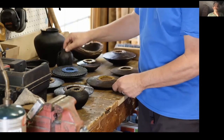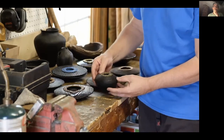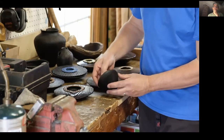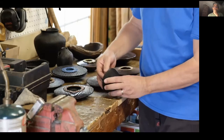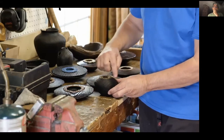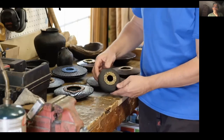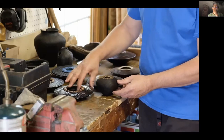And then here's a hollow form that I did in pretty much the same manner, although it's finished in a slightly different way. I put it back on the lathe after it was charred and spun it with the brushes on it, so it makes these grooves of charcoal around that also contrast with the grain grooves. And then I did the same sort of treatment on the rim.